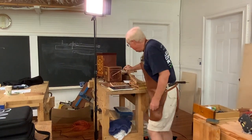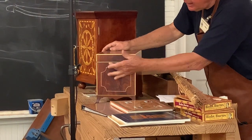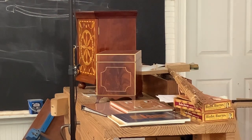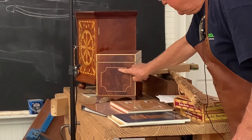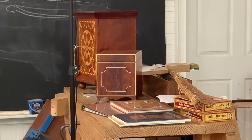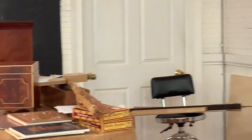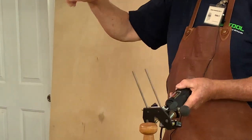And on the side, you see, you've got these little half rounds here. String, plain string, but it's got a half round there. So how do you lay that out? Well, the way I do it is I took a piece of half inch MDF and cut it to look like this, double side taped it down to the wood, and used my Dremel tool with a long shank bit on it. The bit's an 1/8 inch diameter shank, but the cutter's only a 1/16, so you've got clearance. So you can just follow it right around and make that.